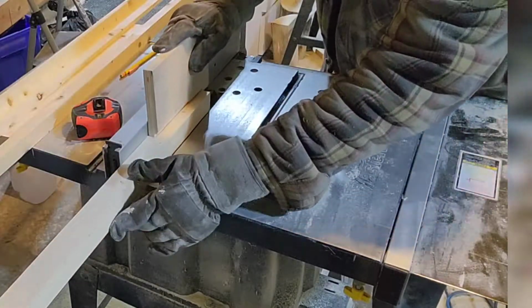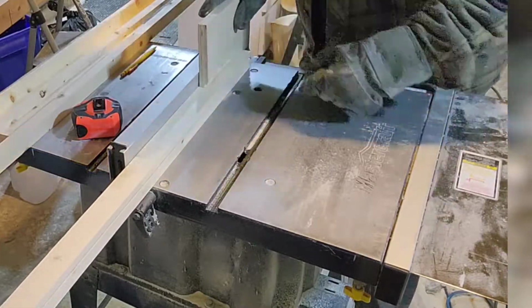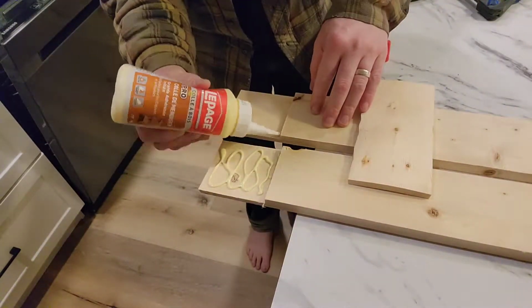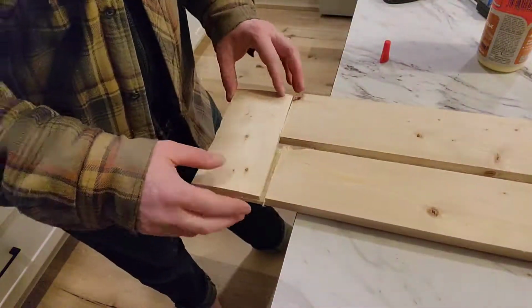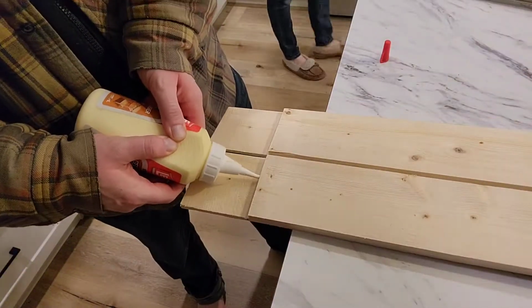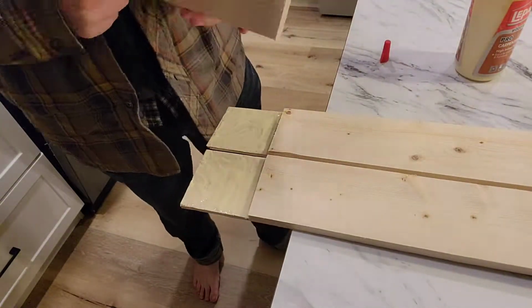The second set of these parts I cut kind of the same, because I need more foot parts, and I'm making more parts to hold up easels. One's going to clamp from the bottom and one from the top, and they can even make more of those things. To put the easel together, I glued these two stretchers, the 5-foot pieces, together with a piece of wood that was the thickness of the half lap, and that gap in there is the perfect width to fit the bolt that I have. It's a carriage bolt with a thumb washer or a thumb turn nut.